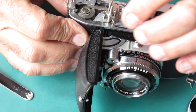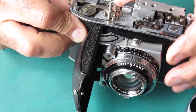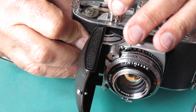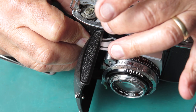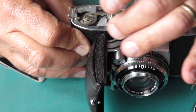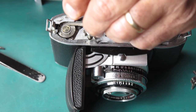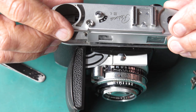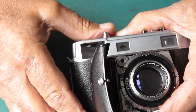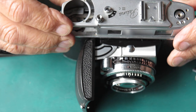What I'm doing is rotating this one way or the other and looking at the way it sits in the hole in the casting. If it's completely straight, I should see the same space either way - and I'm not. It's bent. This needs to come back - this was the way it was before, and that's the other way around, so there's certainly a bend in that shutter release. That leads to other possibilities. Instantly that's nice and smooth in its action - that swung 180 degrees out from where it was.